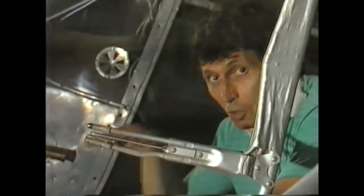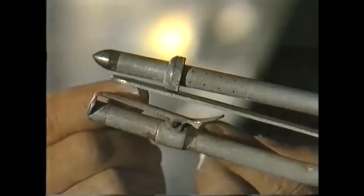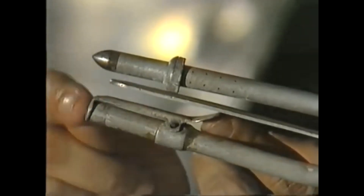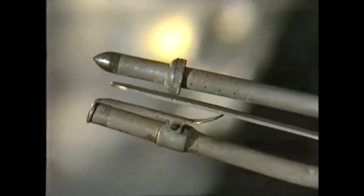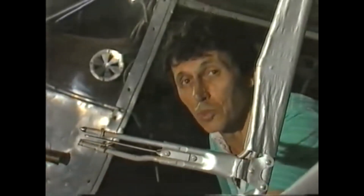When the plane goes up, air will hit the underside of that plate, lifting it so that the lever now drops back into place, covering the hole so that air stops flowing once again. That's registered in the cabin. So the pitot tube — a vitally important instrument in an old-fashioned plane.